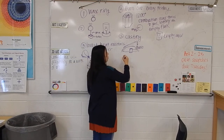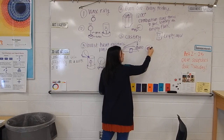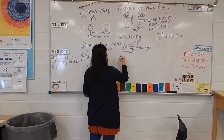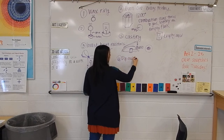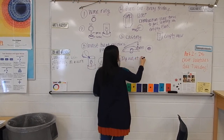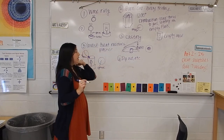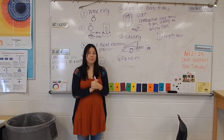After it's been cast, you'll be able to look at the bottom of your flask and there will be a metal button — that's how you know it's been cast and it's ready to be dug out. So that's number six: dig out.